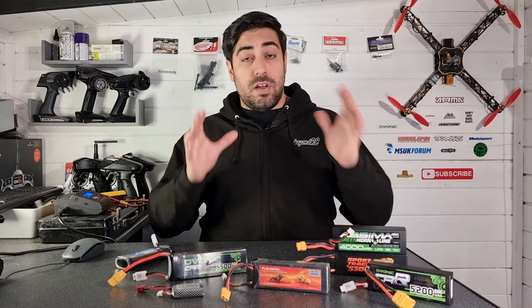Press start — 2.2 amps is already selected from the last battery I charged. If you need to adjust the amps you can do so. We're using 2.2 amps and the cell count is 2S which is 7.4 volts — increase or decrease as needed; this charger goes all the way up to 6S. Go back to 2S and hold the start button. That will begin a battery check to make sure everything is connected properly. It will also flag a low voltage on any cell. In this case everything is fine, so hit start — and that's pretty much it. This battery pack is actually already fully charged, displaying 8.4 volts.